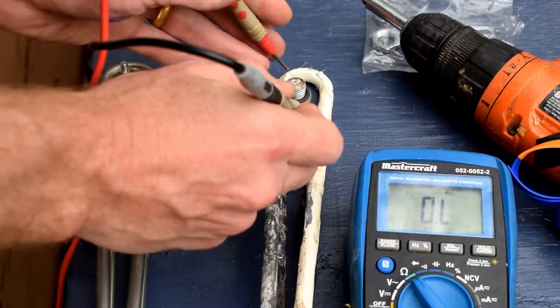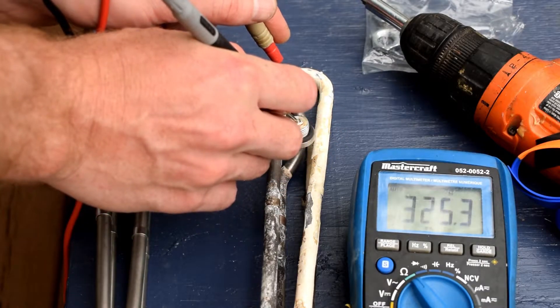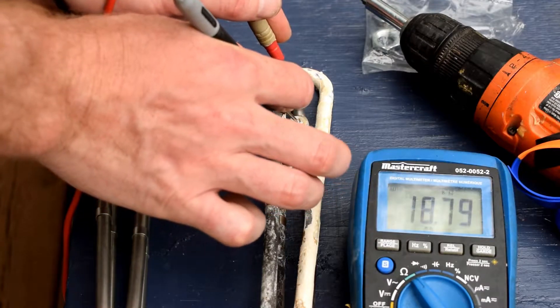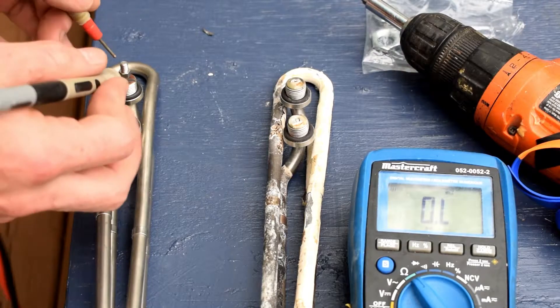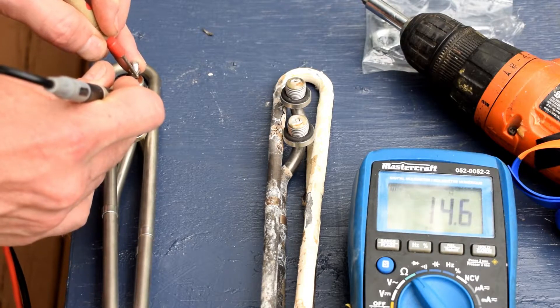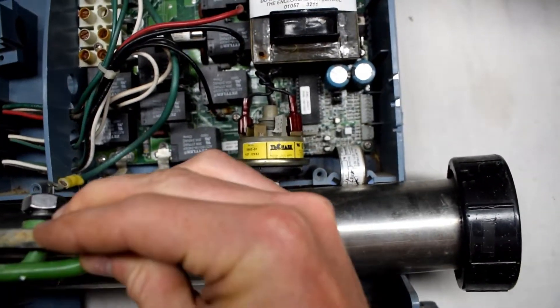You can test to see if your heating element is the issue by measuring resistance between the two poles. If it's broken, you'll see it's measuring in the mega ohms. I bought a replacement one because I broke the other element, and this new one is measuring about 14 ohms — you should measure about 10 to 20 ohms.